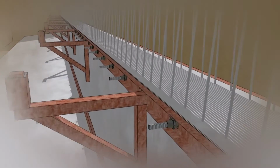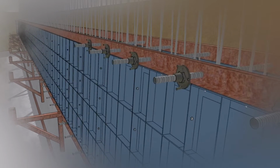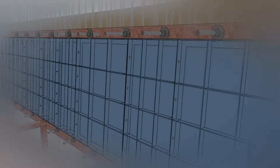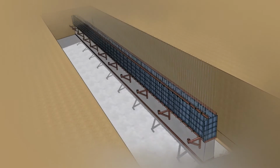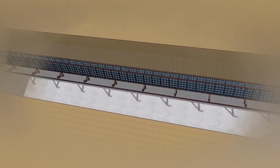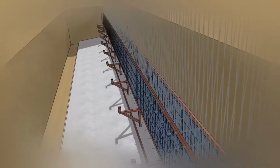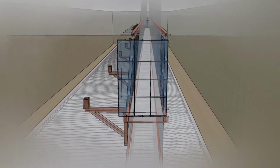So in short, the retaining wall activity breakdown is: 1. Marking point for excavation, 2. Excavation, 3. PCC, 4. Reinforcement, 5. Footing formwork, 6. Footing concreting, 7. Retaining wall first lift formwork, 8. Retaining wall first lift concreting, 9. De-shuttering and curing for 14 days.